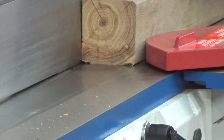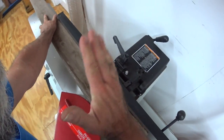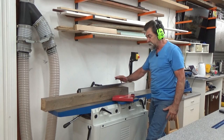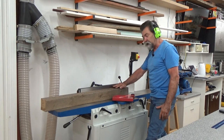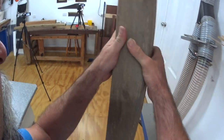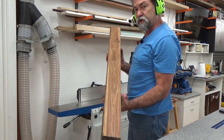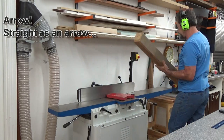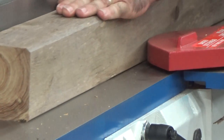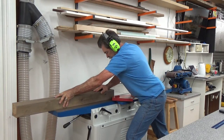So I'm just going to push it straight over. Best not to have your hand hanging over the back — if you have your hand hanging over the back on your palm there, you may end up cutting it. Try and keep it over there. I use it up to about this point, then I transfer my hand to here and get a grip up the front. That's nearly good enough — I'll put it through one more pass. Move my hand up the front. There we go. Beautiful.